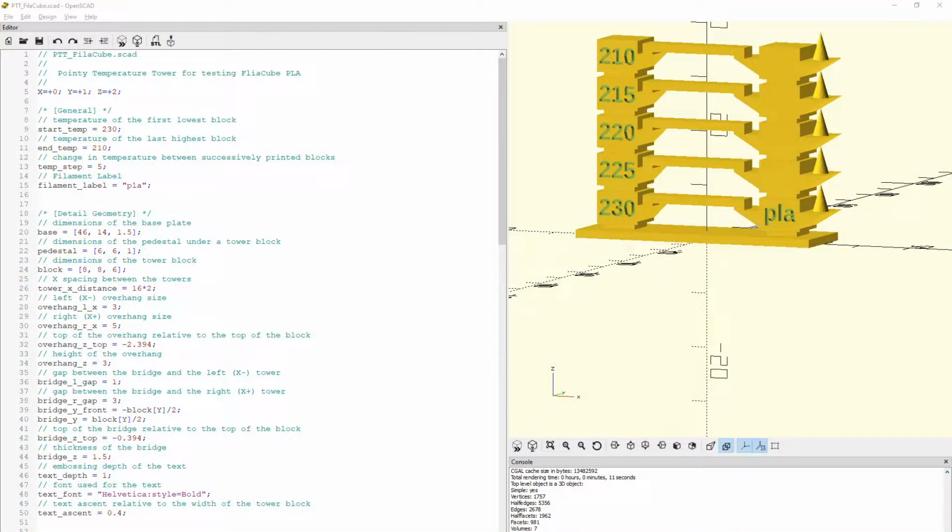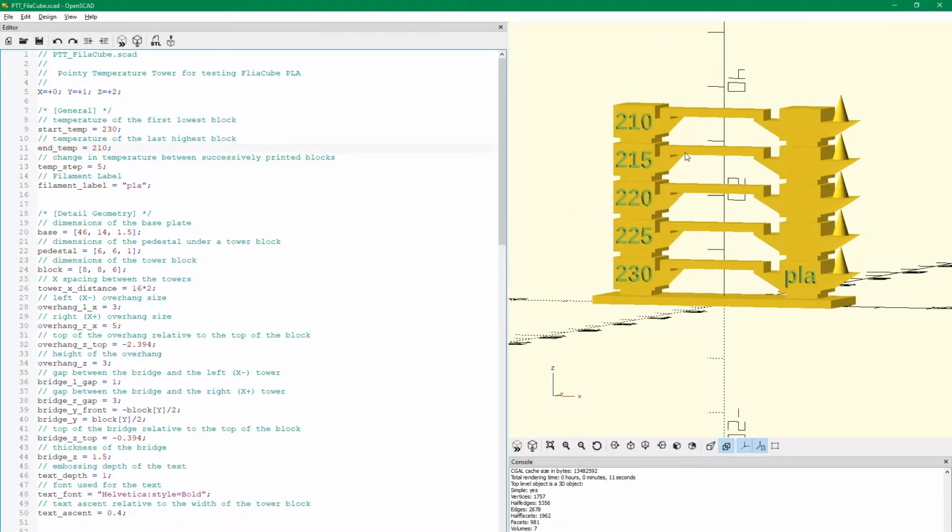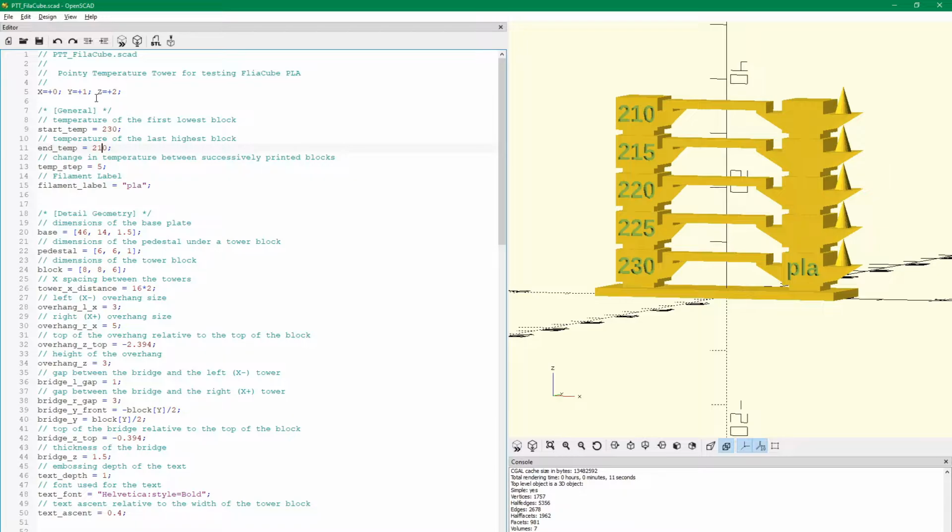So here's our temperature tower project in OpenSCAD. There's a link to this in the description. And so we start out with every filament. You just go over here and edit the starting temperature, which is the temperature at the bottom, and the ending temperature, which is the temperature at the top, and the step. So we're doing every 5 degrees from 230 down to 210. That's pretty standard for PLA, at least on my printer.